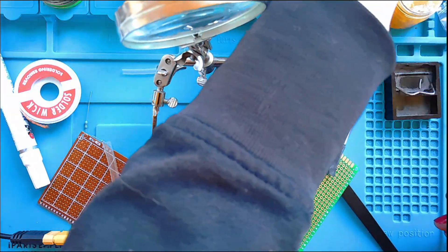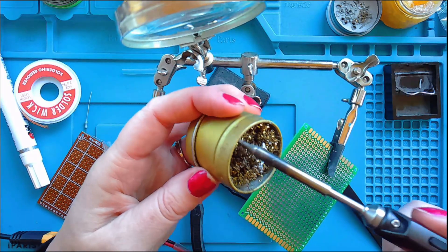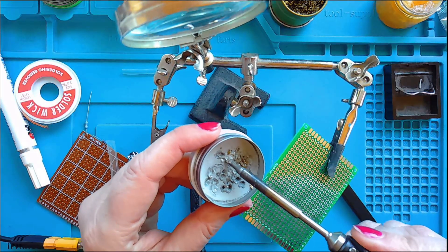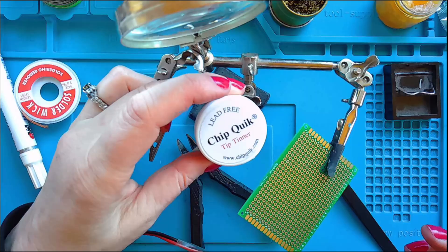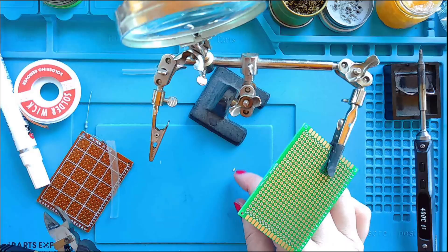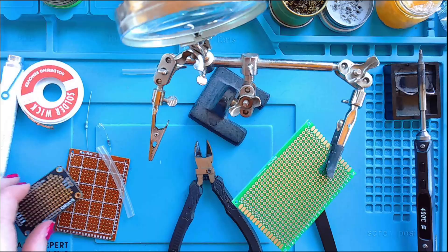I typically use the brass here — this is the brass for cleaning, a solder tip cleaner. This has rosin flux in it, and you just give it a shimmy in there and it cleans everything off your tip. Then you would just grab it and give it a little tap in there as well. This one's a Chip Quick one — lead free — and it is just a tip tinner. It helps keep your tip covered, which protects it and gives it a slightly longer life. You can get replacement tips or buy new soldering irons, but I prefer to keep my tools clean and tidy when I'm working.